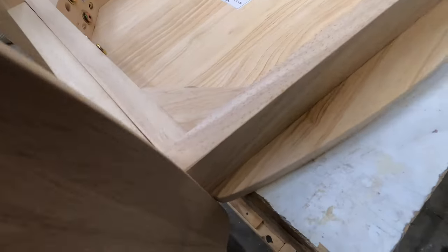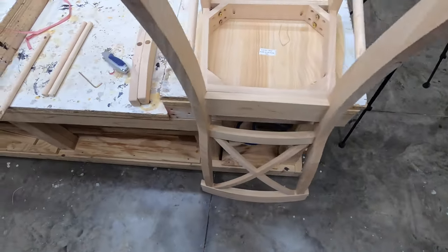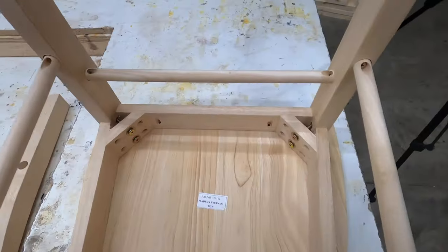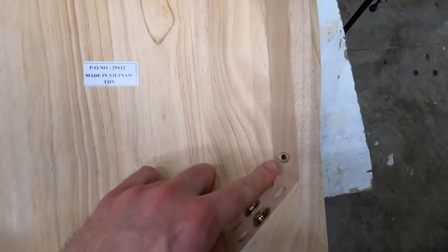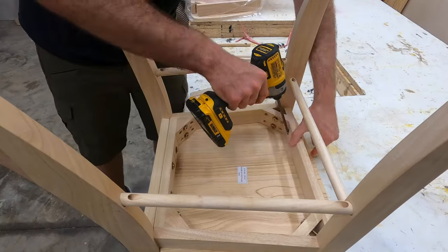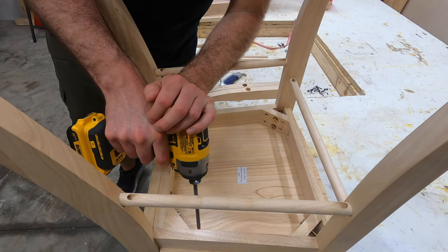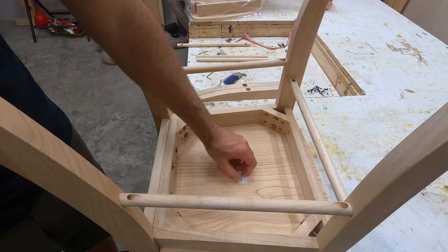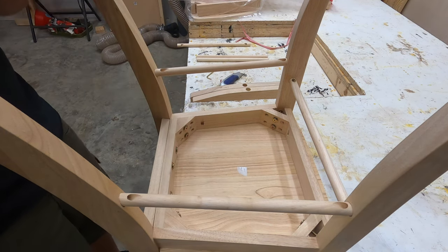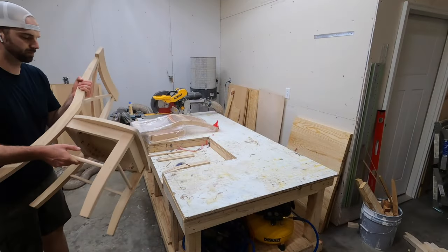The only thing left is to attach the seat to the chair frame. Here I'm using the back leg of the chair to gauge how far the offset is on each side, and you just want to make that pretty close to equal. There are four pocket holes through the frame, which I'm pointing to here, and we'll use screws just like we did on the spindles to attach the seat to the frame. The only real last step was to tear that sticker off on the bottom of the seat frame — so it would no longer be made in Vietnam, and now it is made in my workshop.